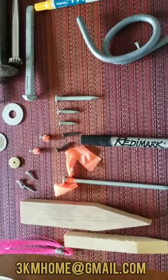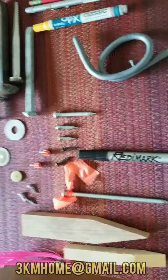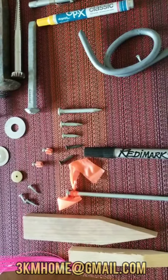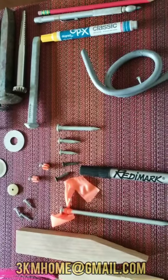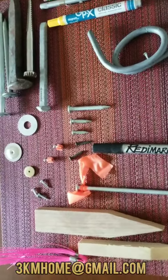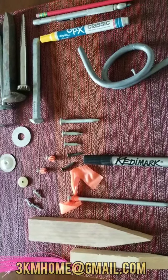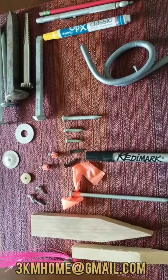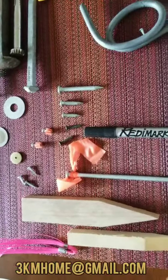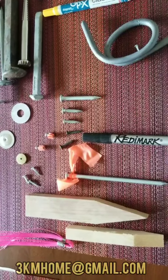I wanted to show some common markers, nails, hubs, and ways that we mark what we're doing — be it rough grade, stationing, curb, gutter, marks on the curb. If you're looking for survey marking points, you might come across some of these, which could be considered monuments or just reference points in general. The lath aren't going to be shown because they just carry the information relating to the point.